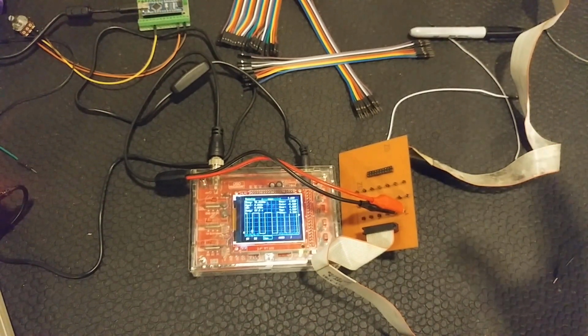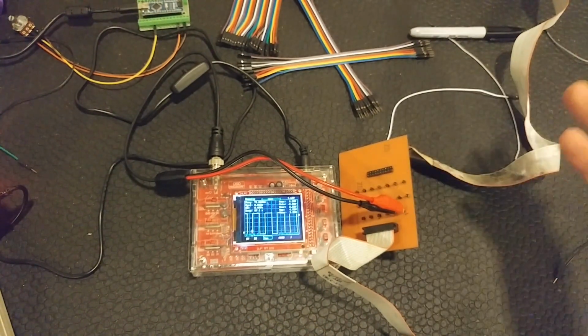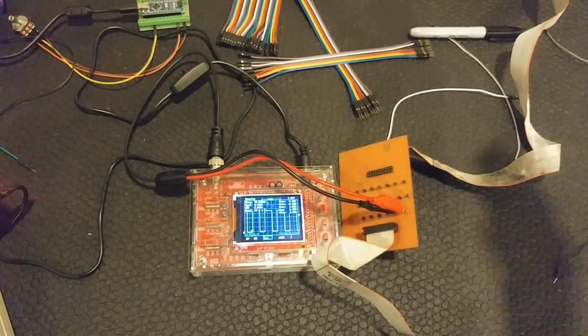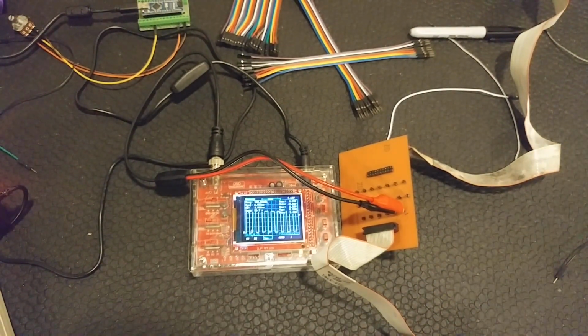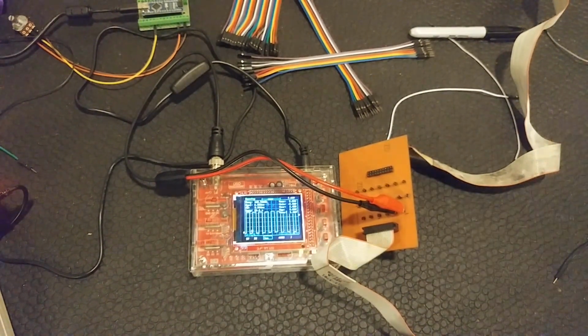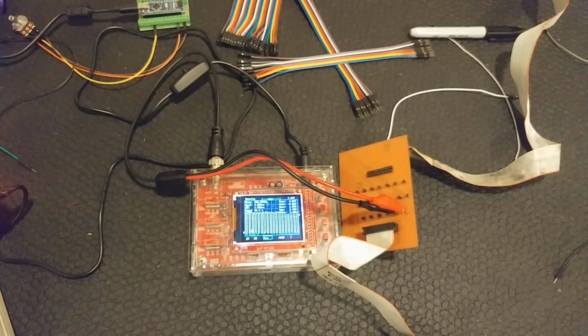It's definitely better than a multimeter, because here you can really see the plot and kind of see what's going on. And maybe if we adjust the speed, we'll see that change. And sure enough, that increased to about 145 hertz. So in ballpark a double, at double the speed. If we go up to 2 miles an hour now, double again. And now we're at 296 hertz. So again, double the speed, double the hertz.